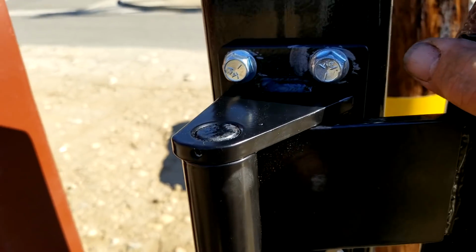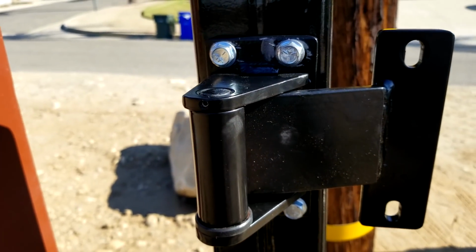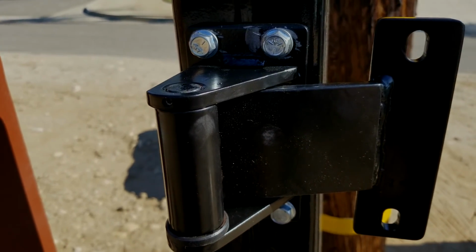We're using threaded inserts into the tubing. The tubing's not just drilled and tapped, it uses an actual thread insert. And they're put together with anti-seize, so a little of that goes a long way. And we'll wipe down after we're all done, wipe up somebody else's mess.